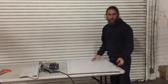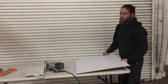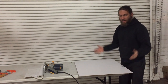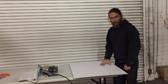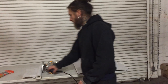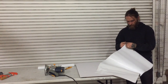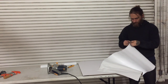We got the bulkhead sides of the enclosure for the stove laminated with Formica using contact cement. I'm going to go ahead and router the edges off. This is actually the inner side of the bulkheads that got laminated first - I'll explain why later. We're going to router this so it's all trimmed up. I'm covering the Formica surface to keep it from getting scratched by the router. You can use masking tape, or I'm using contact paper because I have it and it covers a wide area.